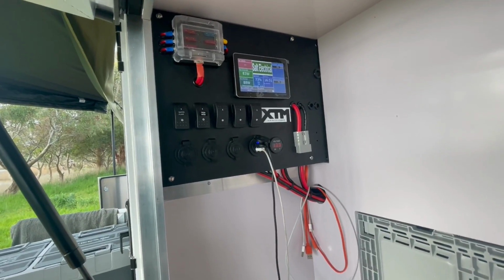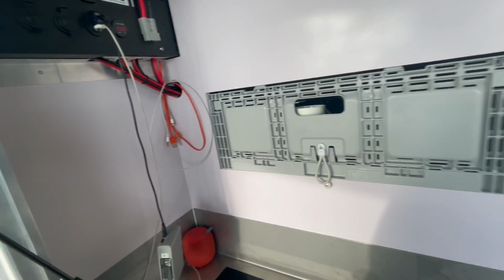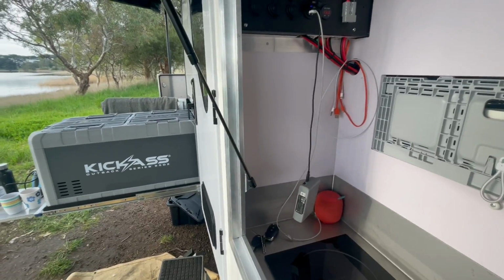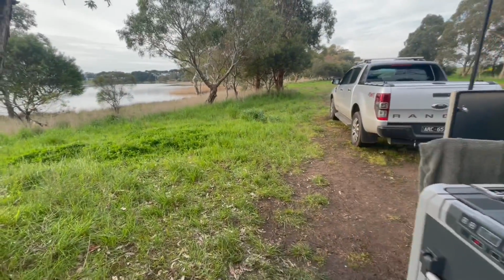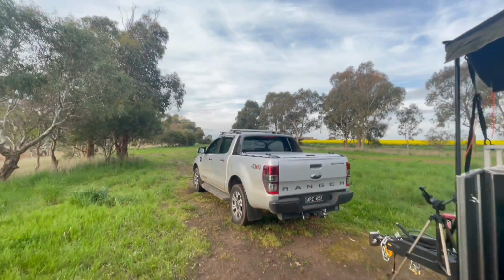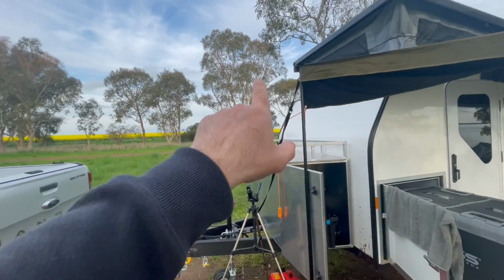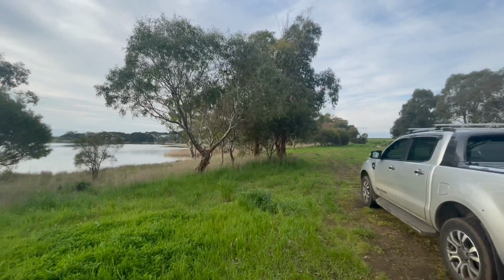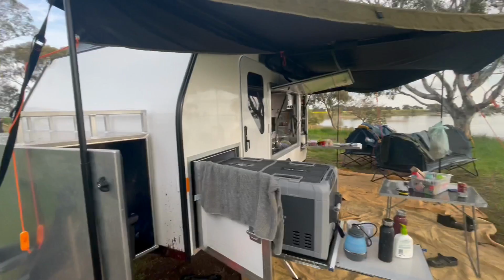Running at 73%. I've set it down; I got it as low as 60 in the last couple of days when I was cranking lots of different 240 things, charging lots of batteries and doing other things. So 73 is all right. I've seen the solar get up to about 500 watts at times during the day today when the sun came out, which isn't bad given that's north and the roof's facing south, so it wouldn't have got maximum sun angle at all. Even at the moment with the sun over there, very low in the sky and cloudy, it's still getting 80 or 90 watts in.